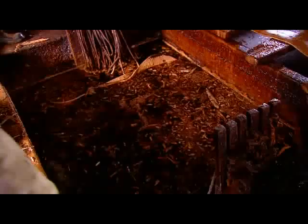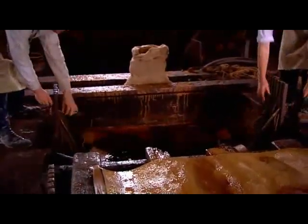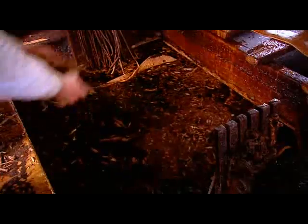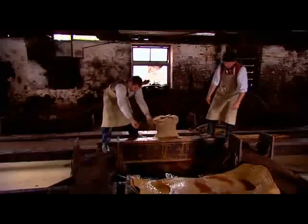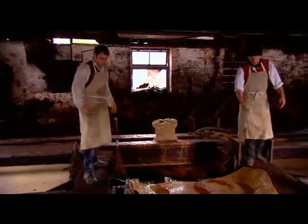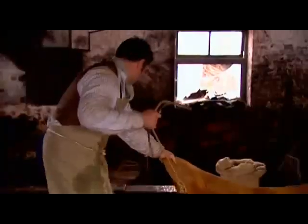After soaking for three months in a weak oak bark mixture, the hides are then placed into a stronger solution. We can put 80 hides into a pit — they're a good six foot six deep. We're going to dust it in: take a couple of handfuls of bark and just spread it around. The tan in the bark soaks out and gradually feeds into the tan liquor, keeping its strength up, because the hides are absorbing it. So this bark is a reserve in the pit, and they'll be here for nine months — they've already done three months, so the whole process is 12 months.